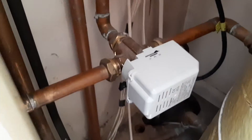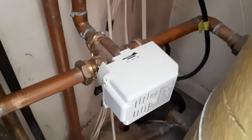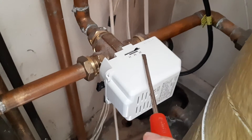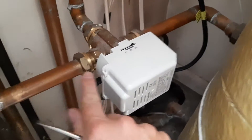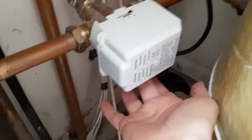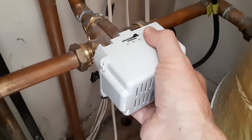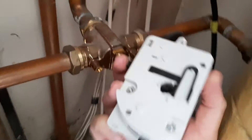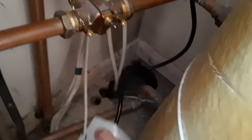At the moment it's set on the water position, so before I drain down the system I need to make sure it's in the mid position, otherwise we're only going to drain the hot water circuit. There's a lever on the side you can use, but what I'm going to do is take the head off. On this Drayton valve, there's a button underneath — press the button and pull, and it just comes off. You can see the button just moves that plastic clip.